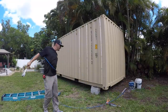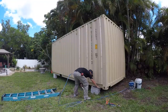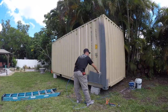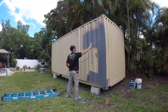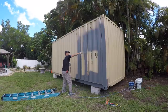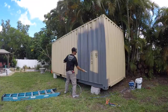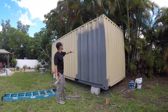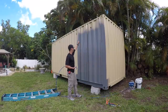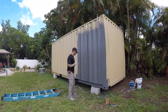Time to start painting. You're not going to see any of this, but I still want to make sure it's covered and sealed really well. Some of it's kind of caulked in with the glue, but I'm still going to go back in with silicone afterwards before I put the siding on so that these boards are really well protected since they're not pressure treated. I want to make sure they're really well coated.